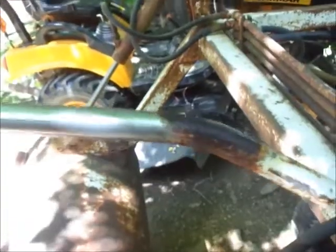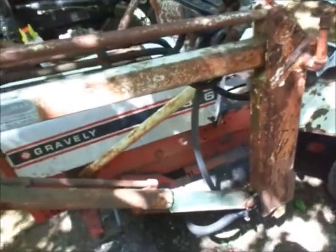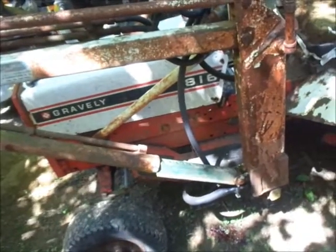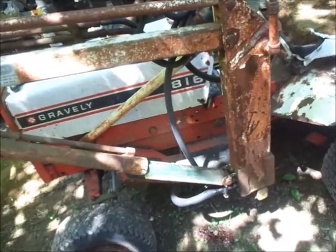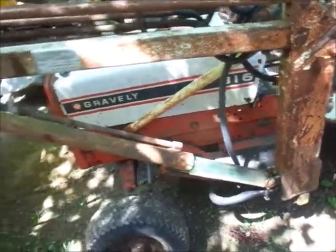So anyhow, I got the cylinder all loose here. It's actually ready to take out. You guys can see the bend. And from screwing with this thing, it's full of ATF, which won't be hard to get, but I noticed this suction line is leaking after I picked the cylinders up and stuff, so I guess we'll take that off and cut it back. It's just a hose clamp, so that won't be hard to fix. Suction lines aren't bad.